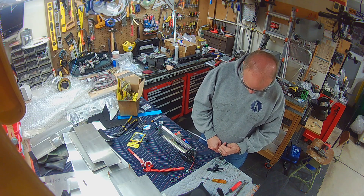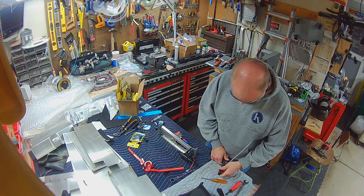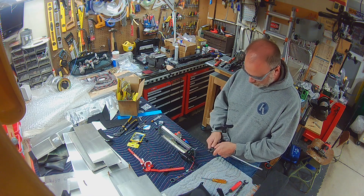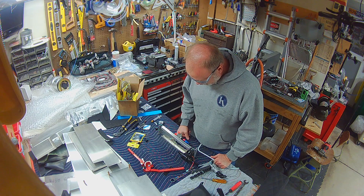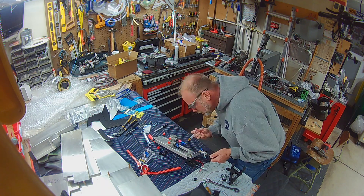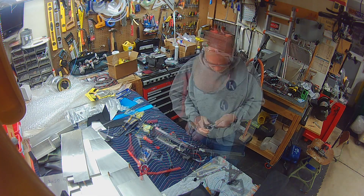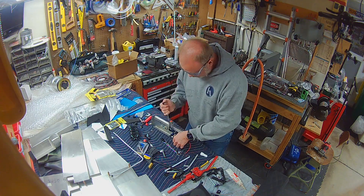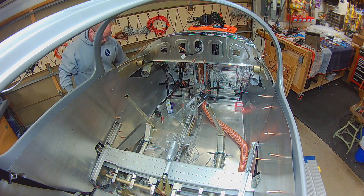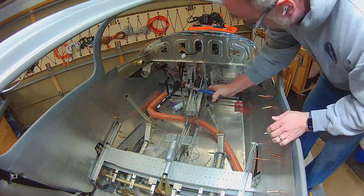This is the fuel flow pattern that this is all replicating. Rather than using rubber hoses, I'm using aluminum lines in this particular case. For those watching, I strongly recommend using Teflon over aluminum lines. I'd already invested in all the tools and parts to do this with aluminum before I started looking at Teflon. Teflon is going to be way easier — it's probably going to cost a little bit more, but from a time perspective it's going to be a whole lot easier. A lot of this is figuring out which is the next section to make connections for and then put the caps on.